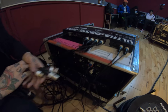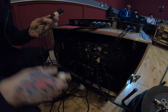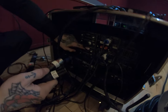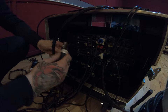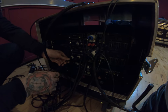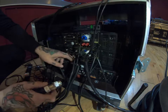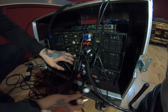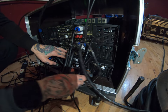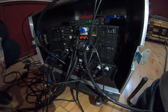On the other side you get your two lows — low left and low right — and they go into your subs amp, which is the second amp. Low left goes into A, low right goes into B. Then high left and high right go down to your tops amp: high left into input one and high right into input two. That's pretty much everything done there.